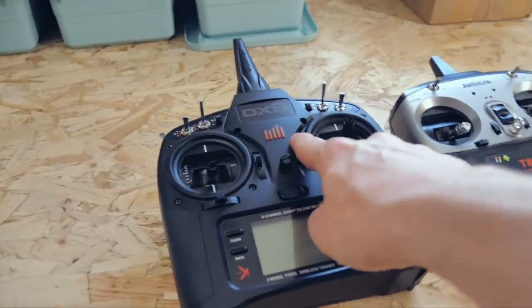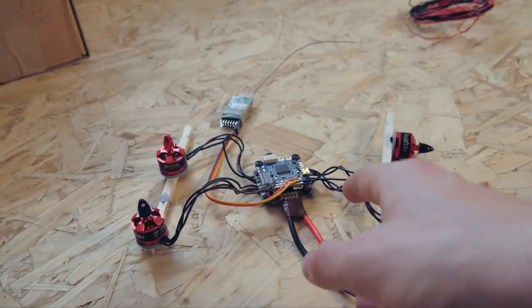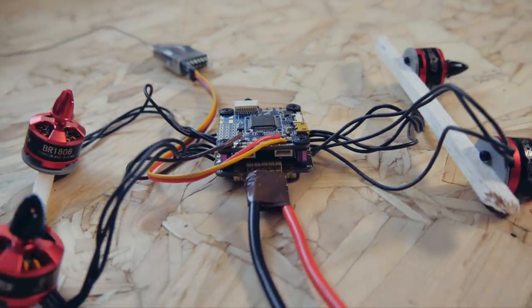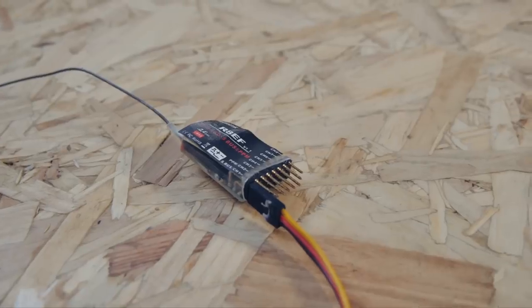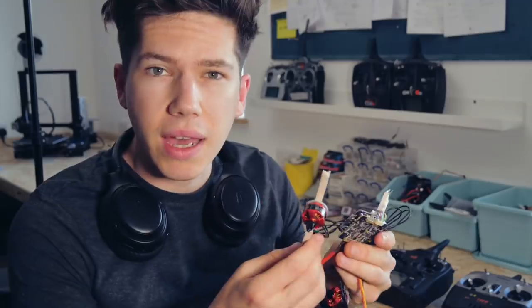What I wanted to do originally was use the DX9 with two receivers — one on the rotors and one receiver attached to the flight controller. Unfortunately, the Omnibus F4 V6 flight controller doesn't work with normal Spectrum receivers; you have to have an S-Bus receiver. So that's why I'm having to use a RadioLink S-Bus receiver instead. So I'm actually going to be using two radios together to control the one aircraft, which isn't ideal. Now that I have the flight controller working properly, I'm going to extend the motor wires so I can fit it to the helicopter on some booms to get a nice leverage and hopefully lots of controllability from the small amount of thrust these motors are going to be producing.